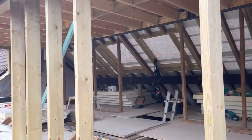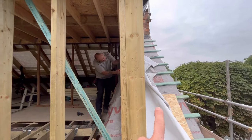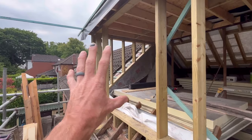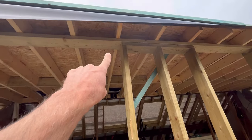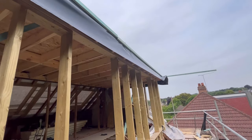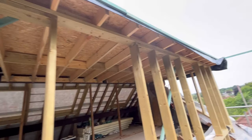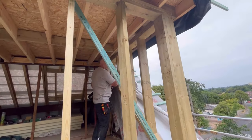So while Mick does that I'll form these in. The plan today is to get all this plywood in today, get it all set and get us all enclosed. The patio area will obviously remain open other than having to put a triple 4x2 beam in there fixed with cripple legs underneath, which I'll show you in a minute. We got done what we needed to get done and we're really pleased. The forecast changed — slight chance of rain today.